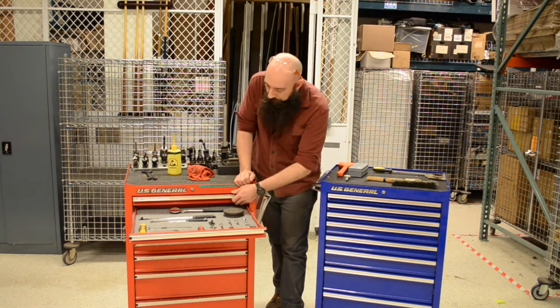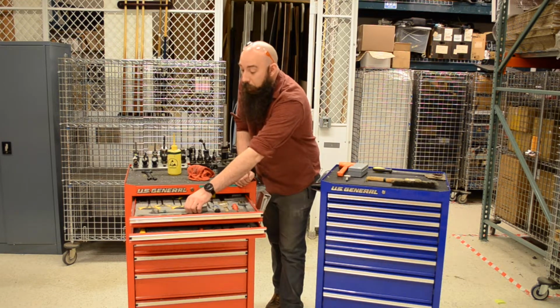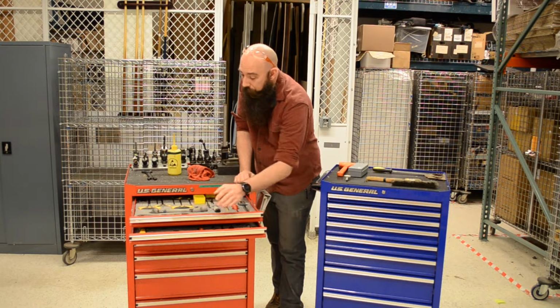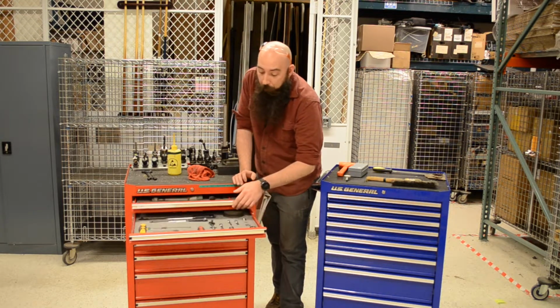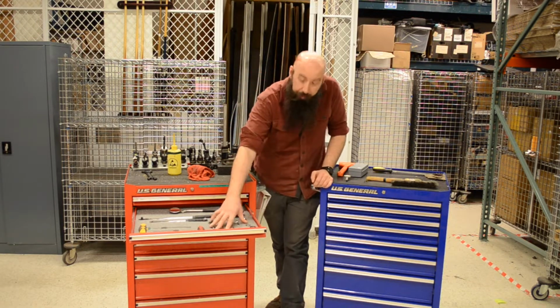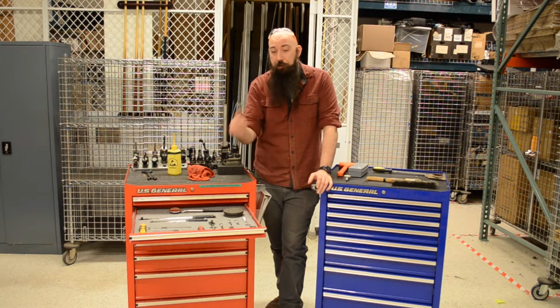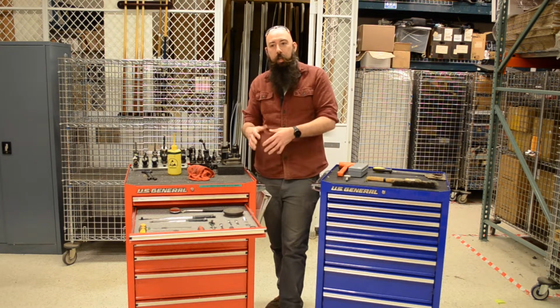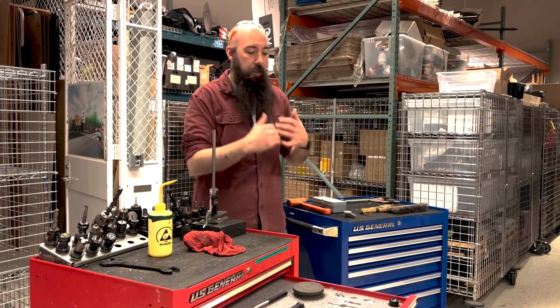We have a couple of tools that are also used. One of the standard tools for opening and closing vices is going to be a 7/8 or 3/4 inch wrench, which we have a couple of here. But on our orange vices, because it's such a long depth, we actually have a whole kit specifically with a ratcheting wrench, a ratcheting socket that just makes life so much easier. So setting up your kit so you don't have to go find that thing just saves you so much more time.